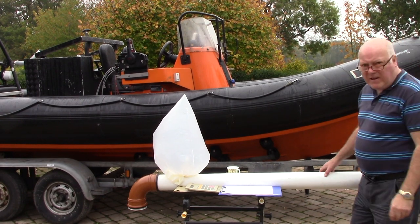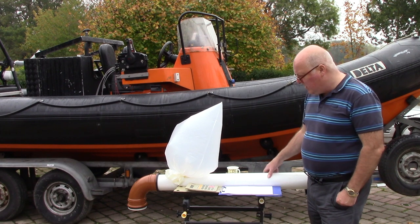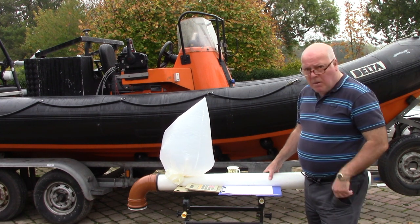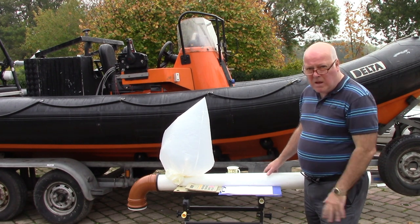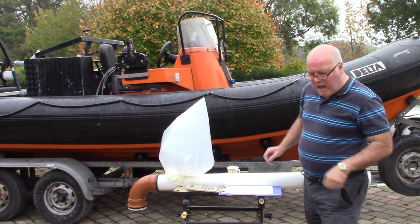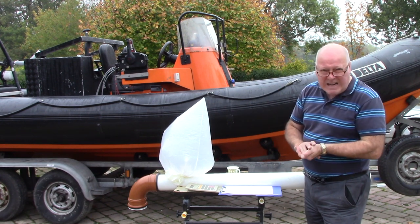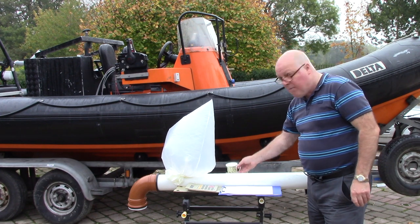We have some figures: this air filter produces 10 minutes of air for one person in 15 seconds, which means it could support 37 people in continuous use — which is going some. Don't forget you need an outlet somewhere within your bunker, house, or room, because this brings air in but doesn't push stale air out. Have a small outlet at the other end of your space. Positive pressure in the room is great because it means nothing can come in — if anything, a little air might leak out through cracks, but it certainly can't come in with positive pressure. Thanks for watching!